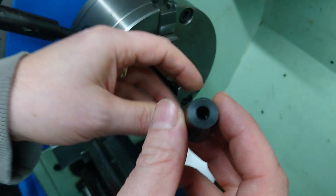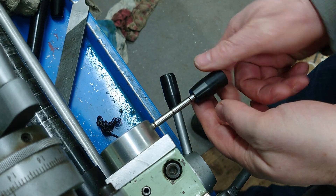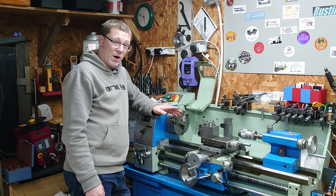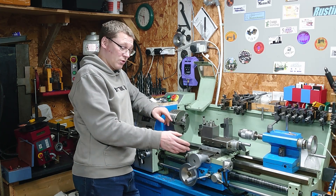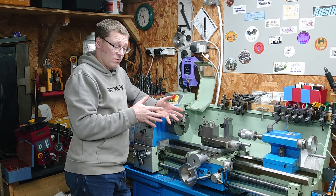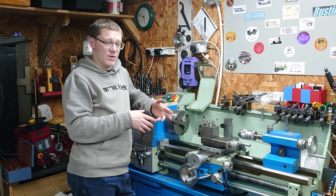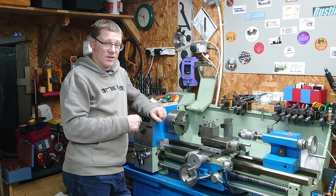Just used a piece of paper to protect it in the jaws there — not bad. Lots more in keeping than a random round ball. As usual that took way longer than I expected and I'm not going to get to finishing this off today. One thing I noticed was that this knob has ended up probably about five millimetres shorter than the original one — there's obviously an offset error somewhere, probably the parting tool isn't quite set up right. Once I've got my head around it all I'll probably make another video with a bit more explanation as to what I'm doing, because right at the moment I'm just making it up as I go along. I hope you enjoyed that anyway and I'll see you next time. Thanks for watching.